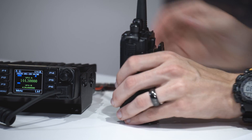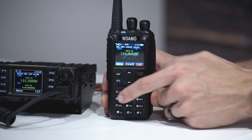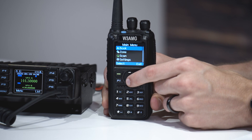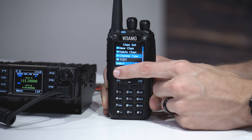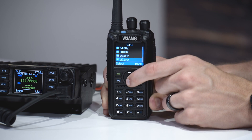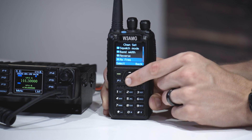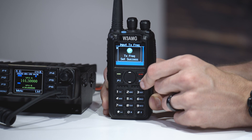Now I've got another radio here. We're going to set this one up too — press P2 to switch from channel mode into VFO mode, then enter our frequency information. Receive: 438, press the pound key. Go into menu, settings, channel set, change the channel type to analog. Set the CTCSS tone to 131.8. Back out, then set TX power to low. Finally, set the transmit frequency to 144.3.